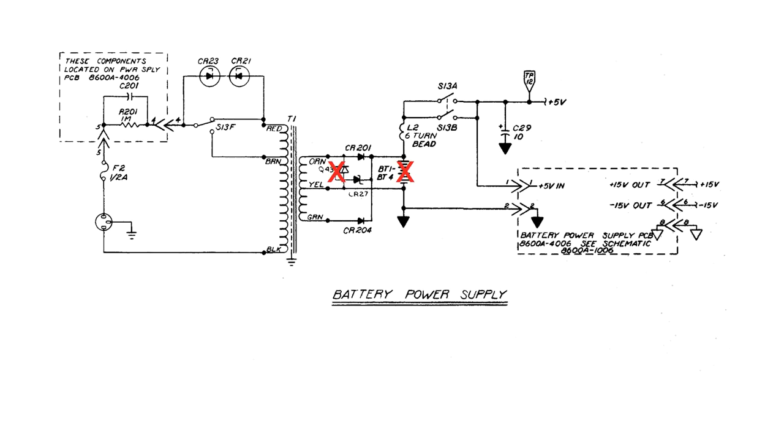I need to remove the triac and the batteries. They are no longer there, so this part of the problem is already solved. But I need to create new conditions for my multimeter. So those diodes have to be replaced. The line they are connected to has some modifications. I must add a voltage regulator and some extra capacitors to it. So let's see how to do it.